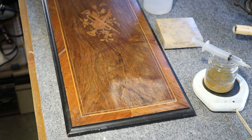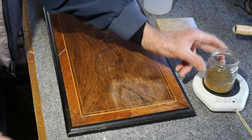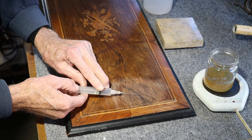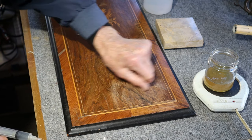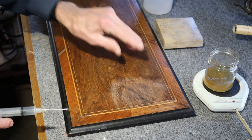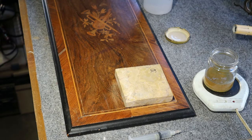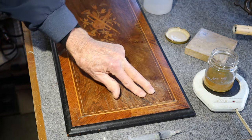Let's get caught up here. I have been unable to video all the processes — it's just too difficult to be working in tedious situations and minding the camera. So I'm going to go through what I've done. Where we left off, we had a lot of ripples here — this was loose. What this is: animal glue sitting on a coffee cup warmer. Bring some up in a syringe, get underneath each little split, and then manipulate the glue back and forth. Thumbnail, scraper, spatula, whatever. Pick up any excess. Then with a marble block that's nice and cool and a weight clamp, and several hours — what you get is everything attached down.